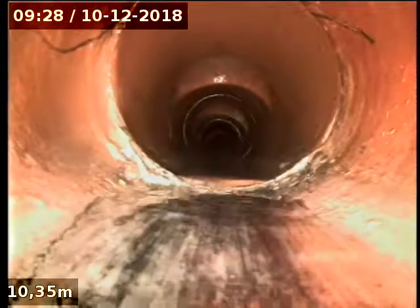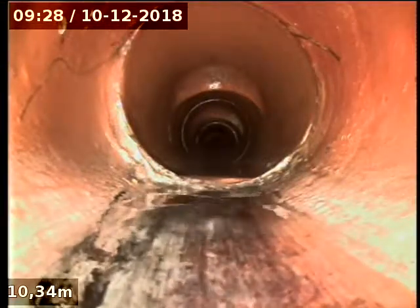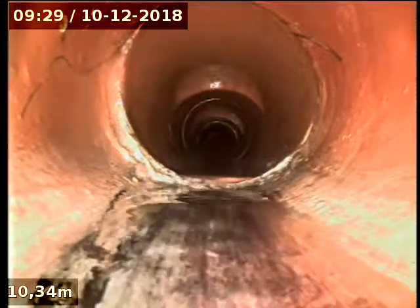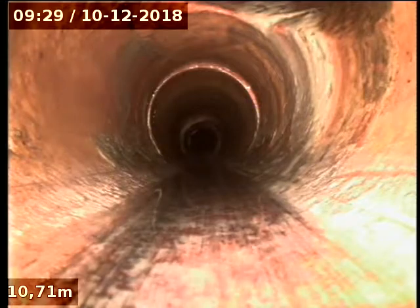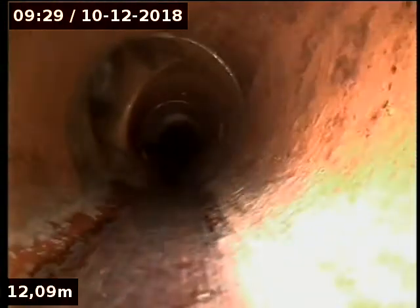It's not at our first junction yet. The joint doesn't look too bad. There's cracks in all of them. They're not leaking up there unless it was full — at the bottom they're leaking probably. That looks like a junction on its back, maybe coming off to the right from 41 — which is the first one on the right. Another junction on the left coming from 39, which is the gully trap. Then there's a toilet stack coming up. They're all rolled up on a 45.